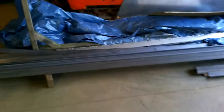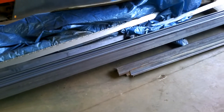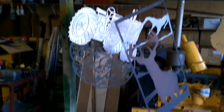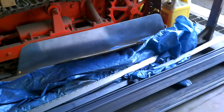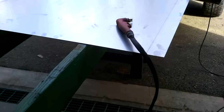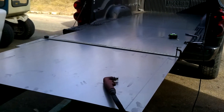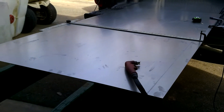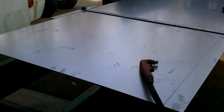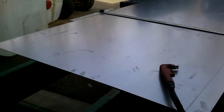Here's some of the metal — I've got a piano hinge for the door, some angle iron to build the door frame, some toggle latches to hold the door closed, and some plasma-cut metal that will probably be sandblasted again. I took the Everlast plasma cutter off the table. I'm going to use that to rip up these 14-gauge sheets to skin it with, and then I'll probably use the plasma table to cut the window and the hole for the gloves.